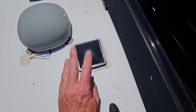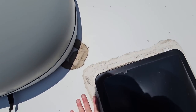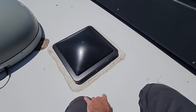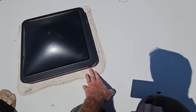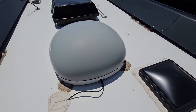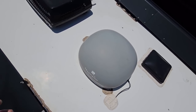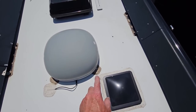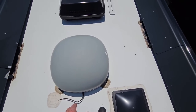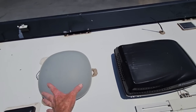Coming to the third fantastic vent — I'd definitely want to have some covers on these. It's one of the first upgrades almost any RV should have; I'm surprised they didn't come from the factory. It looks good — no cracking on the base. This would have been a top-of-the-line Track Vision R6 satellite TV antenna. These are pretty much obsolete at this point, but I wouldn't remove it unless replacing it with something else — otherwise it's holding the place for all the holes in the roof.